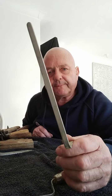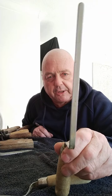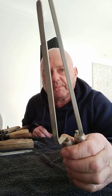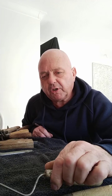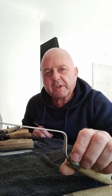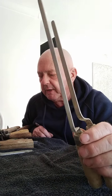Couple of slickers here. Everyone should have these two in their tools. That's a 10mm one. That's a 5mm one. If you've ever got to fill any toothings, anything above lintels, anything like that, actually that's not 10mm, it's 8mm. Most people, the smallest one they have is a 10mm one. And you can't get the gear in it properly. You know, with these you can push the stuff in.